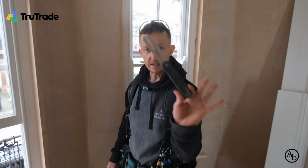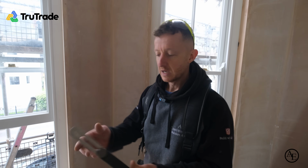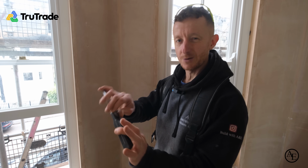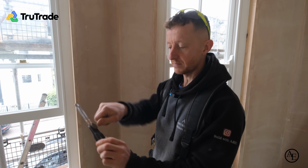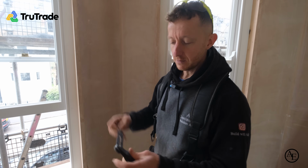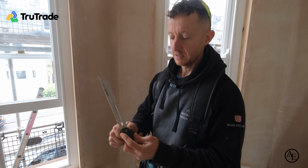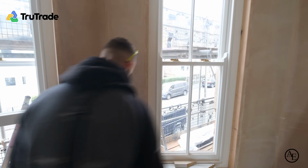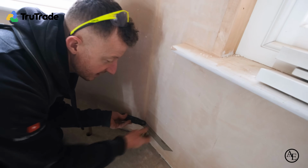What you're going to need is one of these. This is called a bevel. I like to go for one with a wheel rather than a big turny bit on because that doesn't get in the way sometimes, whereas the little lever bits can do, or the wing nuts can do. You need to open your bevel. Tighten it a little bit, just quite loose so it moves, and then what we're going to do, we're going to go down here. Our skirting is going to be like that.